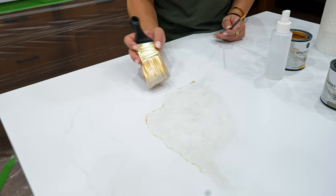If your remaining section of countertop is less than 6 feet, use the appropriate amount of epoxy to cover the area. For instance, if your final section is 3 feet, mix the last full set of epoxy and only use half. Once you've rolled on your top coat, do not add more unless you find bare spots. Doing so can create unwanted blemishes in your finish.